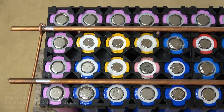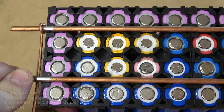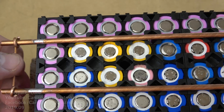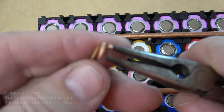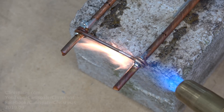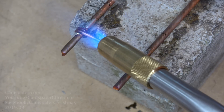With the loop at the edge of the pack, I'll measure where I want the crossbar. I wrap the wire around the bar — it's loose right now, so I can still adjust it. I want these two bars to be right in the center between the two rows of cells, so I'll wrap the other side. If I needed to adjust the length of the crossbar, I can pull it off and use some needle nose pliers to roll it out just a little bit. Once I'm happy with everything, I'll solder that in place. This goes a lot faster than using a soldering iron — I did have to flip these over a few times to get rid of globs of solder, but I like this version better and it seems to do what I want.